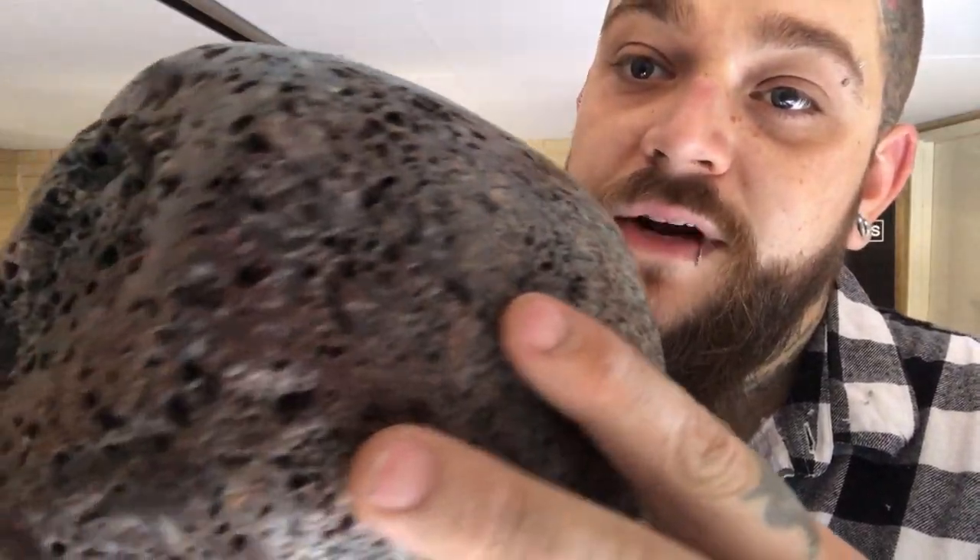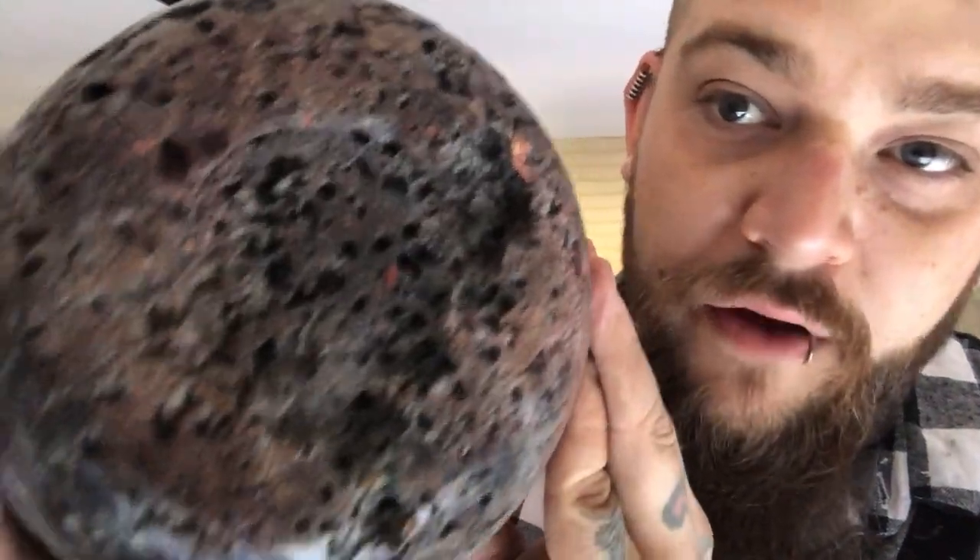I think we're going to call this one a failure. The eight screws held up really well in the faceplate and we managed to turn the outside, but as soon as I took my first few passes I could tell this was not going to work. You can see all the air holes from when the resin expanded all through this - it almost looks like a bit of foam or honeycomb. I put the mortise in the back for the chuck to open up in expansion mode and hold on to it, but that didn't work. The pressure of the chuck just busted the mortise all around. No more lathe for this one. I think I'm going to try this on the drill press and see what we can get out of that.